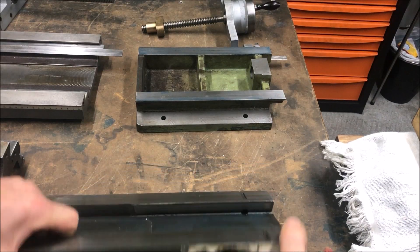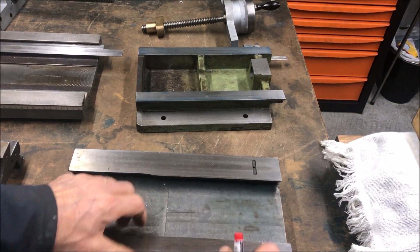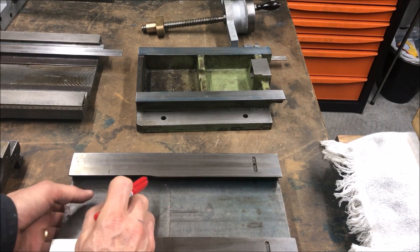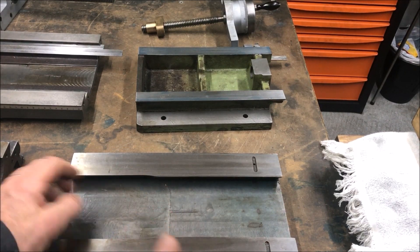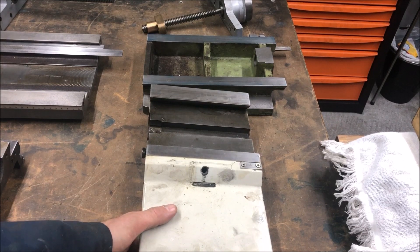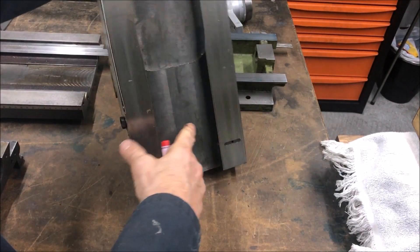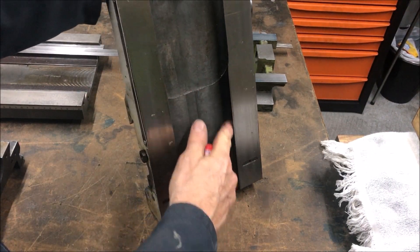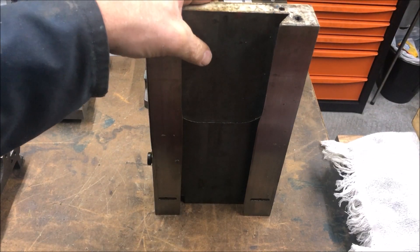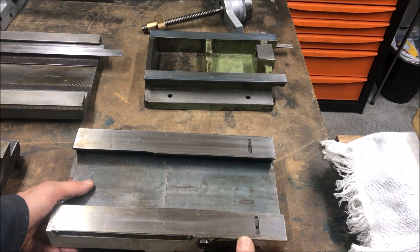And this is the saddle, or also the in-and-out feed. That's why it's on to the casting. This is the bottom here, and you can see here they have relieved the part that is towards you, so that when you go in and out, it's only touching on this part here. This is actually relieved here. I'm not sure if I liked that, but that's the way they've done it — it's probably as a tribute to Golmatic. I guess that's where they've seen that.